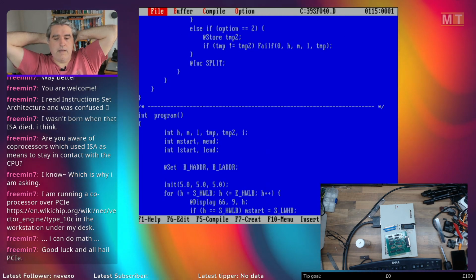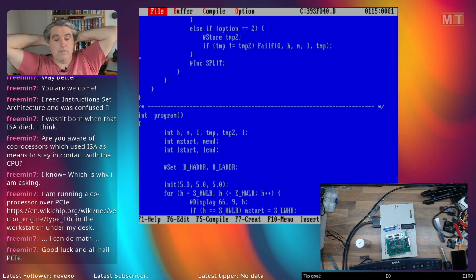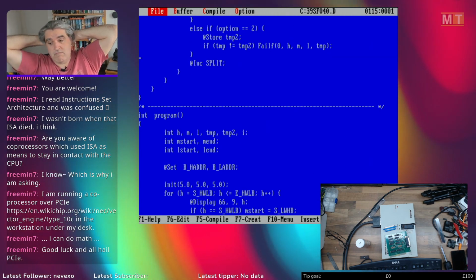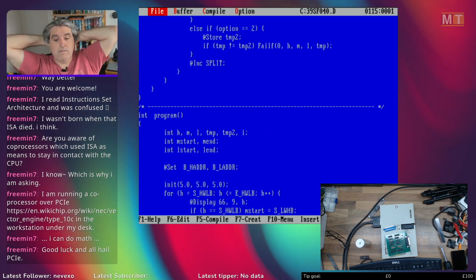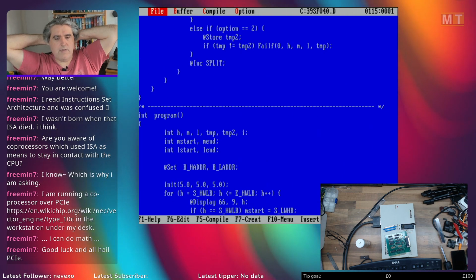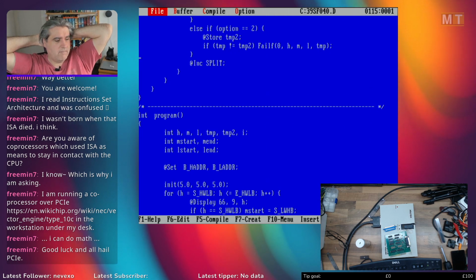The harder part is it requires a plus 12 volt and a minus 12 volt power supply, because some chips require those negative voltages. Obviously you can't get those from USB, but with boost and inverting and switching power regulators, you can generate those voltages. So that's a possible future avenue to take with it. Lower priority, though, I think.